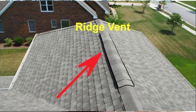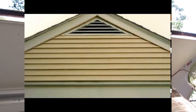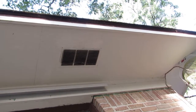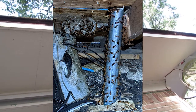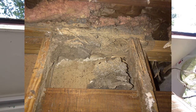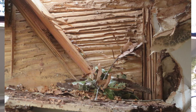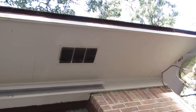You may have what's called a gable vent, which also has a screen that needs to be checked to see if it's missing. If you have missing screens, wasps can build some really large nests. We're entering the Formosan swarm season and when they start swarming, they can go through these vents and create aerial colonies in your attic. That's a really big reason why you want to check your soffit vents — Formosans get worse every year, not better.